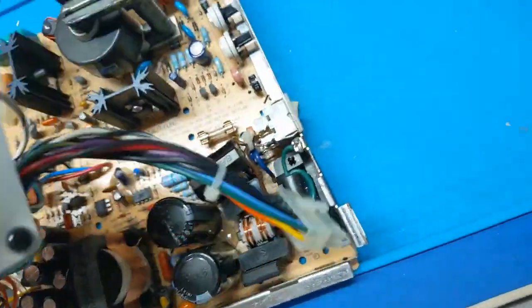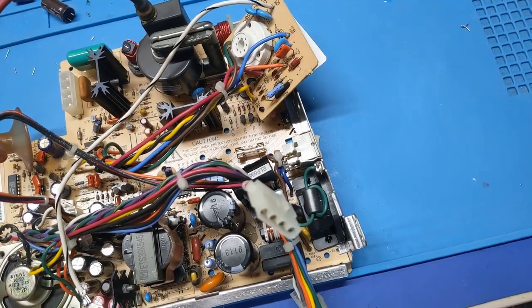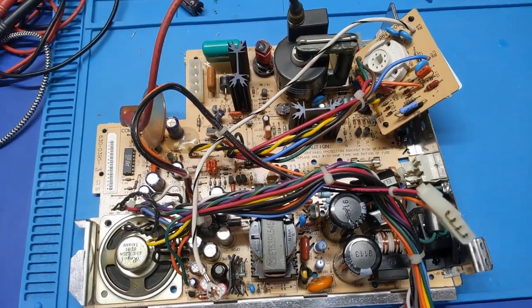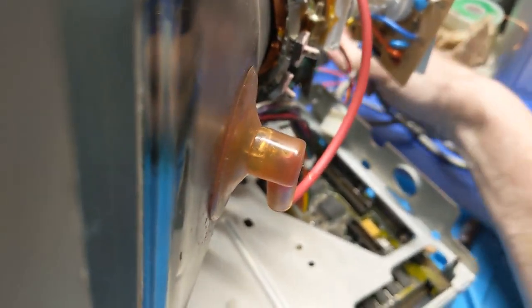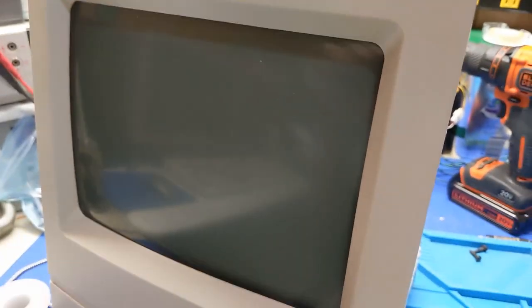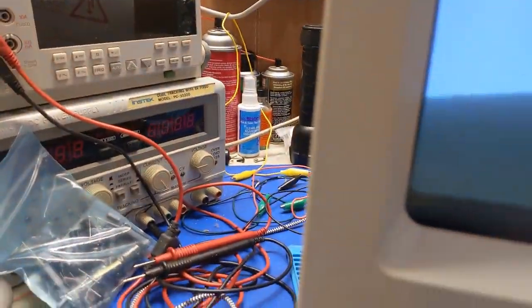I forgot about that thermoplastic, so that got a little bit scorchinated, but who cares. More importantly, we need to clean up the copper that's been completely eaten away and destroyed. We're going to need to clean all of that up before we can start recapping it and seal it in place. We only did a partial recap because that's all that's really necessary at the moment, and I had to double up capacitors like I did before. I got the speaker VHB back down in place so it's not going anywhere, and I got the flyback transformer reinstalled and this resoldered. So it's time to put this thing back together and see if we get a chime or if everything blows up in a ball of flames.